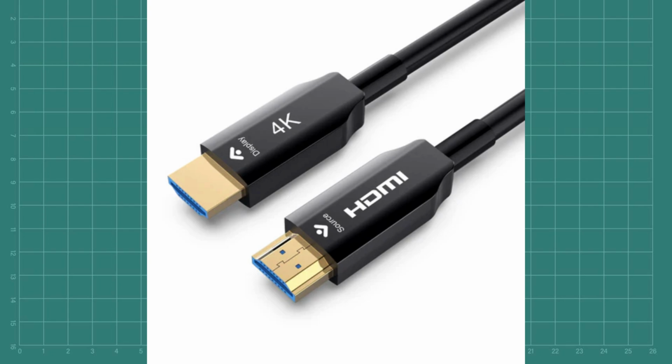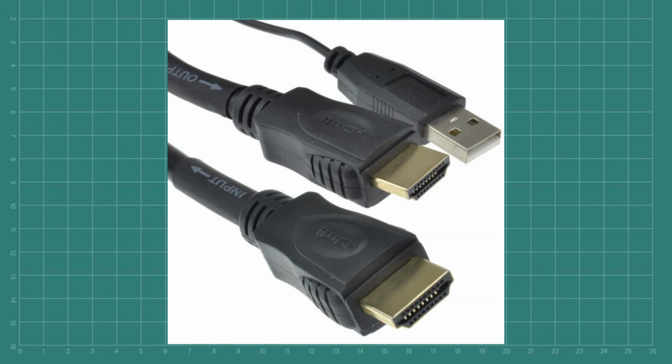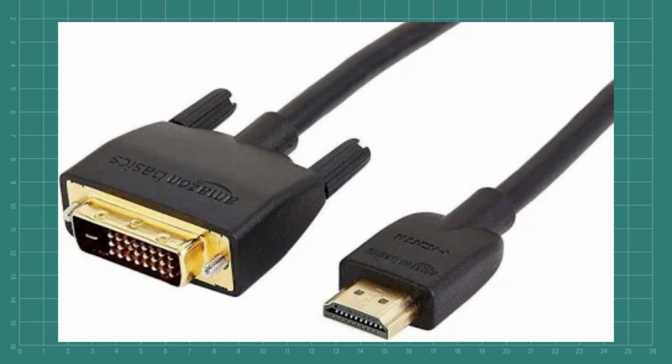2.0 and 2.1 cables are considered to be active cables due to often having bidirectional components, and the ends of the leads are often marked source and sink or source and display. Some of these active cables even have separate power supplies for longer runs. But the important thing is that we're talking about a DVI-D to HDMI converter cable and not just HDMI cables. The converter cables follow the HDMI 1.4 pin connections, and the additional spare pins that were used in HDMI 2.0 and 2.1 are not connected to anything inside the transceiver. So I think we can categorically exclude this from our investigation.